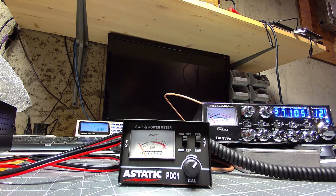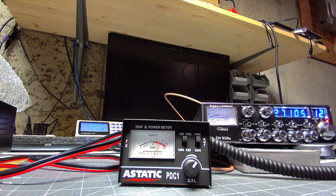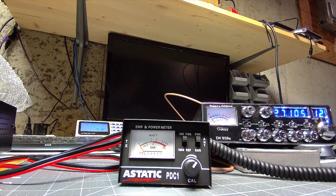If you've got a radio that's advertised on the package as 40 watts PEP, it should be doing about 10 watts of average power if the radio is modulated to 100%. Without an O-scope or some sort of modulation meter, if you want to spend money to get a true PEP meter, you're probably going to have to spend about 200 bucks. You might find one on Facebook, but if someone's trying to sell you a meter that says it's PEP, it doesn't have a battery in it.